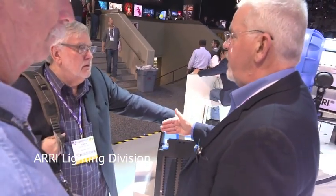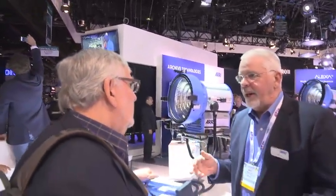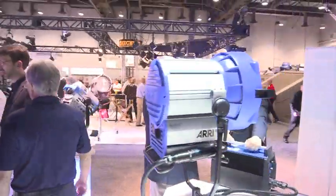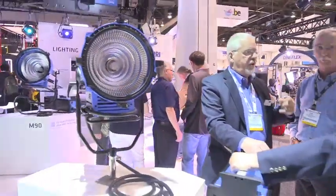It pulls a little less. You're not going to get the same thing with a magnetic ballast or a non-ALF ballast. Non-ALF ballast, number one, is going to draw more current. And, of course, with a magnetic ballast you get out what you put in. Once it is running and stabilized, then you don't get that voltage rush.